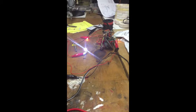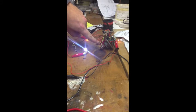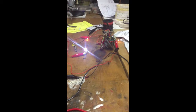And then one nice thing that I do like about this setup is when these get powered on with the integrated circuit that's on the board, I believe it's a 555 like most people use, there is no dimming of this LED, which is really what I was looking to accomplish, because it's going to allow me to light the inside of this. I'll be able to run some fiber optics to the windows and that sort of stuff, and I won't have dimming of everything when the blinkers turn on. So I'm pretty happy with how that is going to work out.